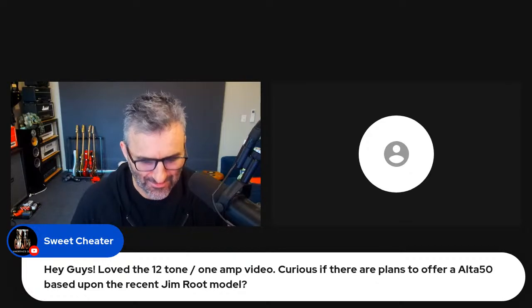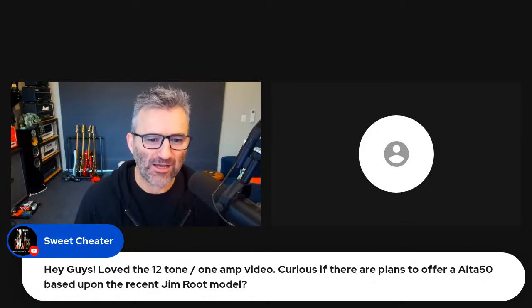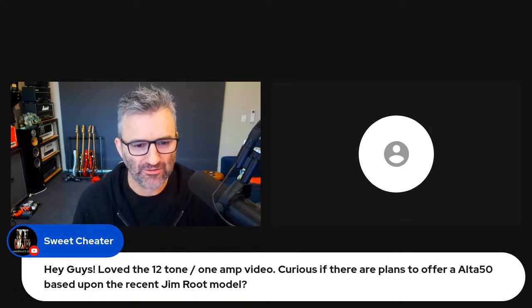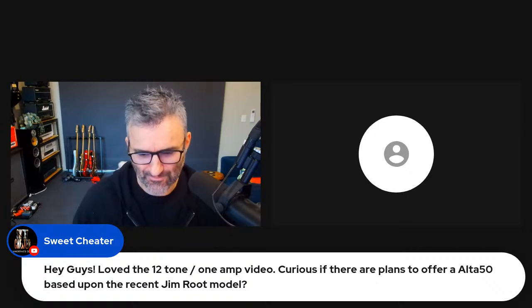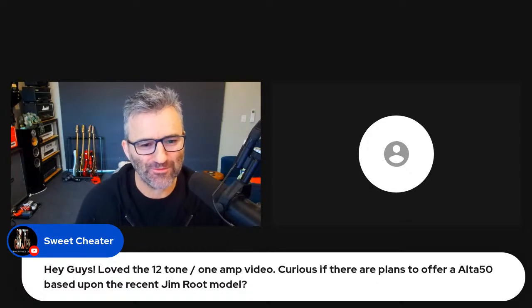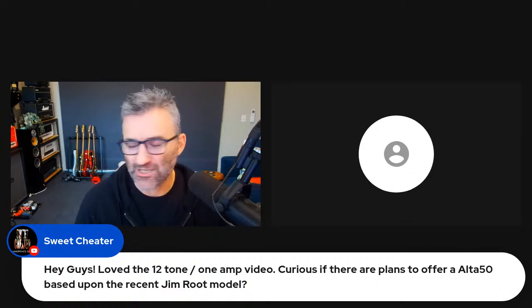The Alta 100, sorry, I was saying. I purposely designed it to fit in a Marshall small box head cab. So it's the same physical size as a 50-watt Marshall, like a 1987X or a JTM45, the Marshall small box. It has a half power switch on the rear, which lifts the cathodes of two of the EL34s. So I think the amp covers the 50-watt segment. It's the same size as a normal 50-watt amp, only marginally heavier because of the transformers, and can run in genuine 50-watt mode.